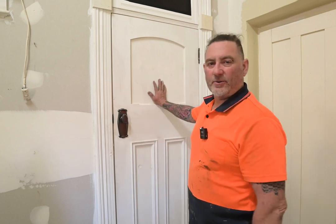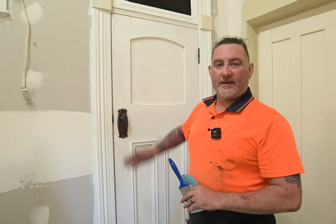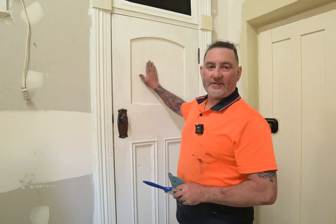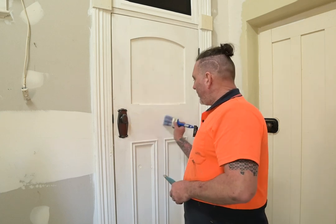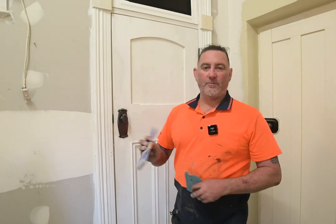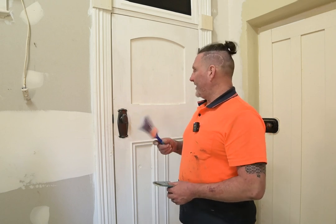While I'm working on these doors, sanding, painting, everything that I'm doing, I'm keeping along the grain. So any scratch, any brush mark, or anything will add to the look of the grain. If I start sanding across ways and start taking out all those ridges that I put in with the undercoat, it's just going to make it look flatter. So everything will be brushed along the grain, so that I add to the grain look more and more with every step. So that's just a little trick.